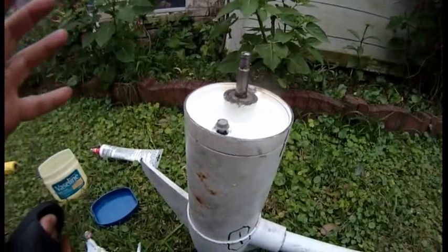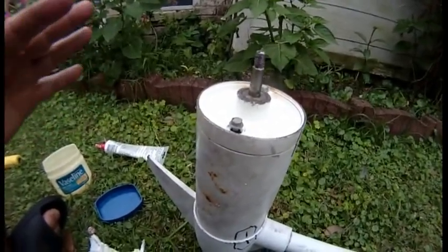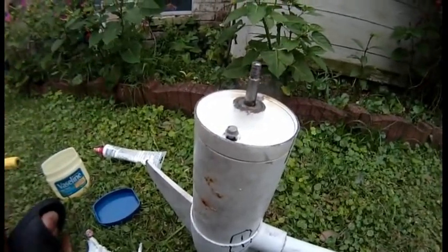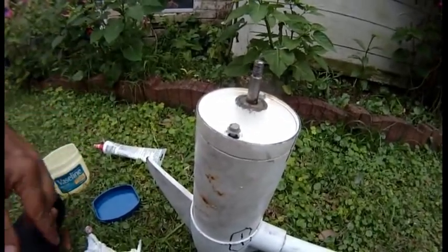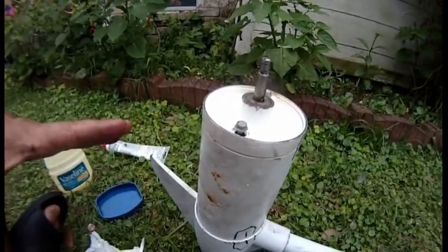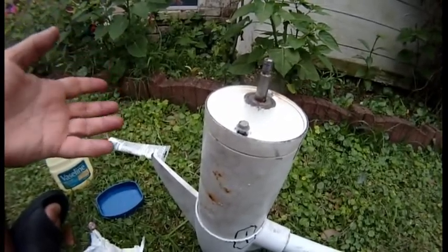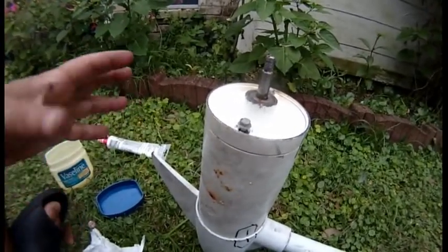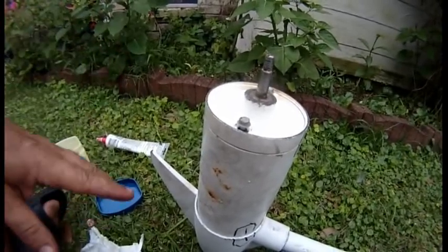And pay attention to that rubber seal, it has changed shape. So it will have an up and down position, and put it back the way it was, or look at the shape, because it's been under stress and it has molded to the shape of the body of this trolling motor. So it will have an up and down. It looked like a cup to me, in a very slight way, because one side was higher than the other side after 10 years of being held captive inside of there.